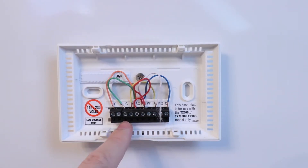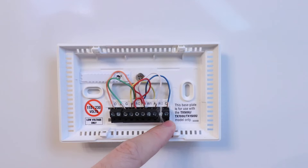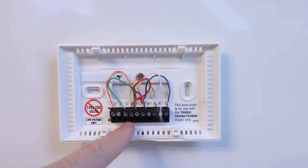Now it's more involved than just moving the G wire over to the C terminal. You would actually need to go down into your heat pump system and move the G wire at both the thermostat and the terminals in the heat pump system. We have a whole other video that explains how to do that, so take a look in the description below.